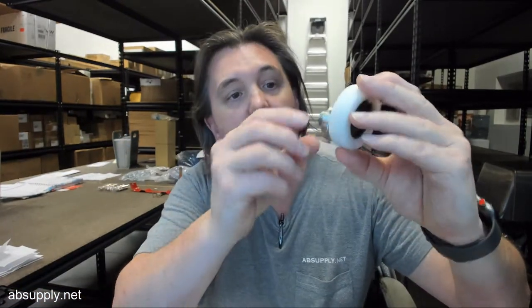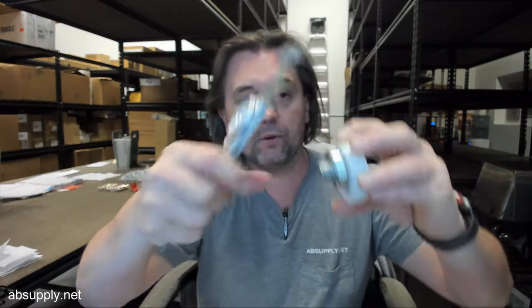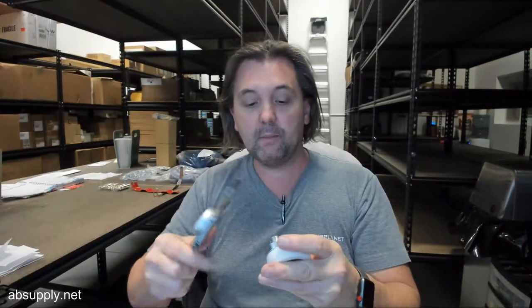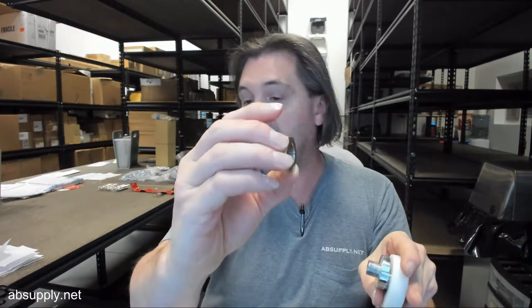You can see that there is an eccentric sort of positioning on the wheel in the back. Diameter of the spindle for the nut: 1.372. Diameter of the threaded portion — and I don't know what thread type this is, it's probably metric — .626. It certainly looks like it's not standard, and you've got that flat hex nut that's there.